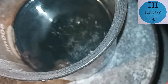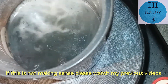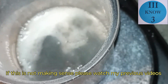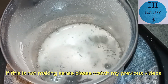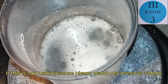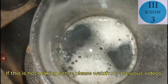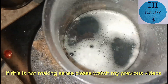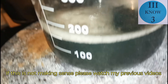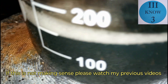If you watched the hydrochloric acid copper substance test, you may remember that I took a piece of the same zinc material and dissolved it in hydrochloric acid and was left with a copper residue. What happened was the zinc displaced the copper, but for some reason the outside passivated and the copper was still displaced on the inside of the zinc. That's why there was copper residue left behind when the zinc dissolved.